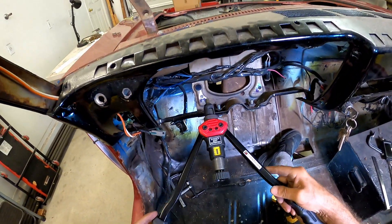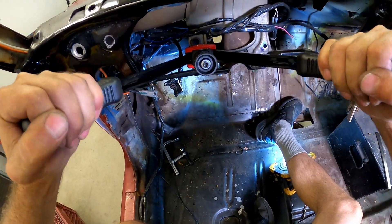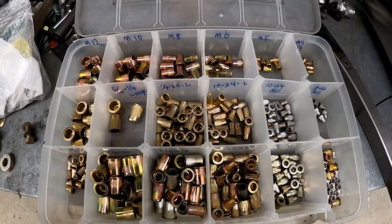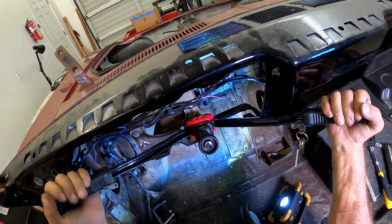In this particular area I started out by using rivet nuts, or nutserts if you will. It's an easy way to add threads to something that doesn't have any. Size 10-24 is the most common, but I have an assortment. In this case these are quarter-twenties.